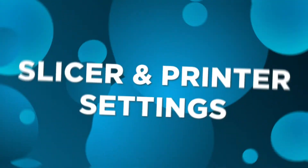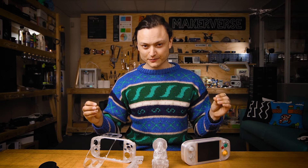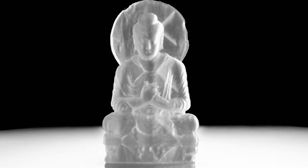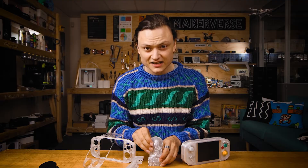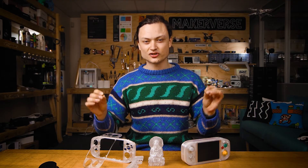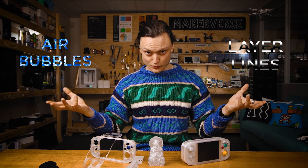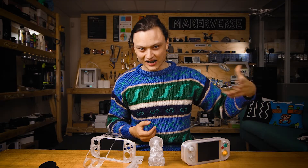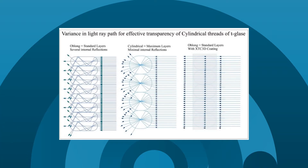If you're using fresh transparent filament and get the settings right, you'll end up with a translucent milky material. They definitely let light through but it would be a stretch to call it transparent or glass at this stage — it is the post-processing that takes these parts to a higher level of transparency. Now, air bubbles and layer lines are the two main enemies to clear and transparent 3D printed parts. Air bubbles give an opportunity to bounce light around inside the material, and layer lines effectively act as lenses which also bounce the light around inside them.